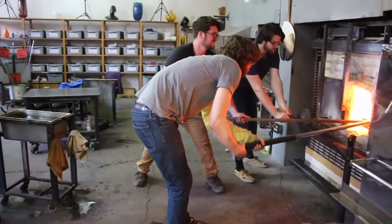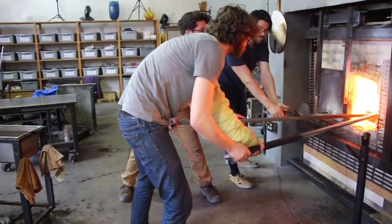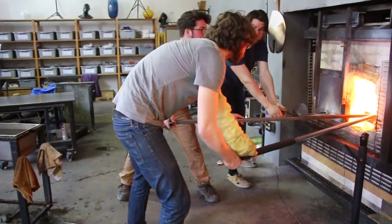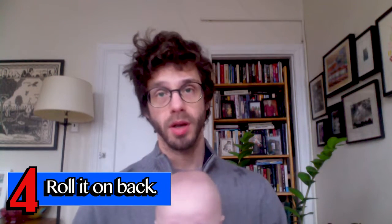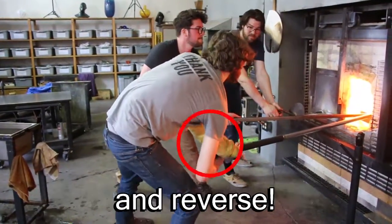That teamwork is critical to being able to work big. Here you see Mike Jess using a rake to help me elevate the pipe I'm gathering on. When you have a really full furnace and a really big gather, you can come all the way to horizontal and still be submerged in the glass. One thing that's kind of unique to big gathers is to roll counterclockwise right before you come out of the furnace. All the way up until then I've been turning clockwise against the side of the port like a normal gather, but right when I'm done and the glass has broken free, I roll counterclockwise to come out straight. That helps you come out quick and clean without tagging the sides. You can also turn the burner down right before you gather.